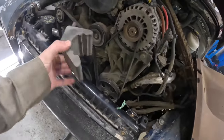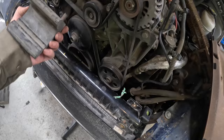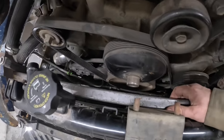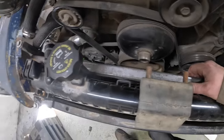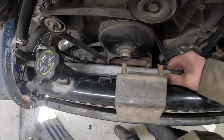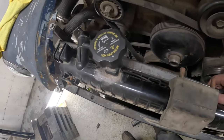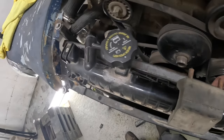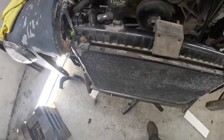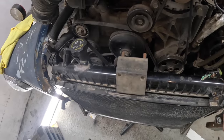Okay, we've got a game plan. I took this block off the original core support of the Envoy — this is actually shaped for the rad. Originally it was like that but I'm going to reverse it, put the support on the back side. It's going to be probably square tubing. Turn it on the back, build a bracket to weld from there to there, keep the rad down in place. And then this bar I'm not going to weld in — I'll bolt it in to each side of the fender mounts, just so it's really easy to get the rad out if I ever have to. Otherwise I'd have to pull fenders or at least move the fenders out, which I don't want to do if it's just a rad replacement. So if I can unbolt the bar and swing it out of the way, I'll be good to go. So we're going to start building this crossbar.